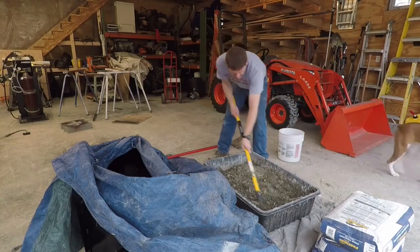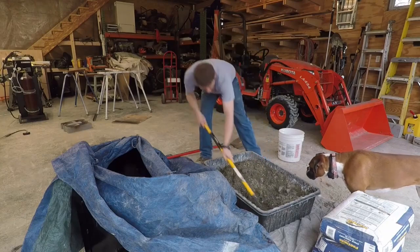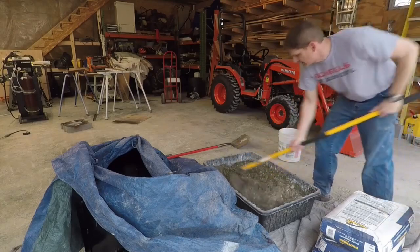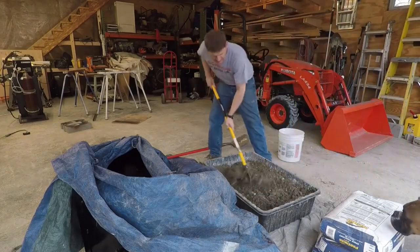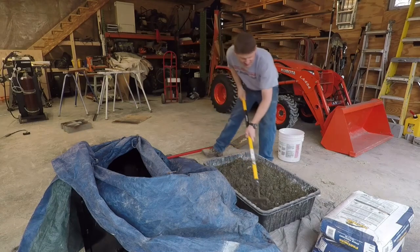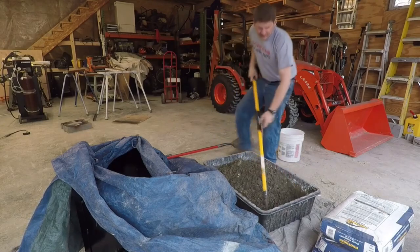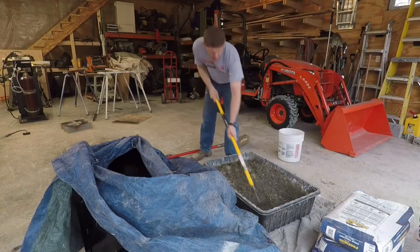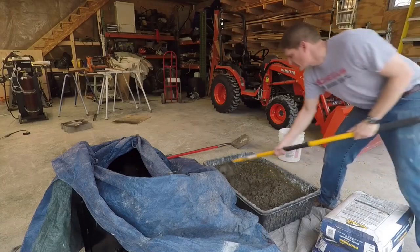Bags here, and then I've also got some. I've got three 60-pound bags, so I think I'm gonna probably do 4, 5, 6. I'm guessing I've got about 100 pounds of steel there. And I don't know that I really want this little B tractor to be much over 600 pounds. I think the three-point is rated, don't quote me, for something like 1,700 pounds, so I don't think there's really any weight concern.